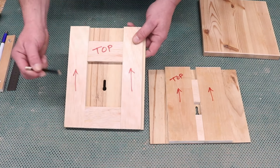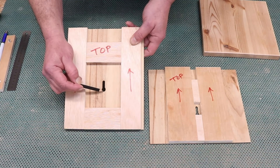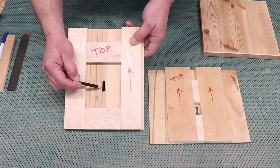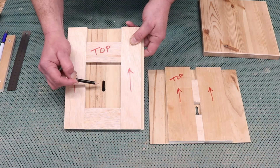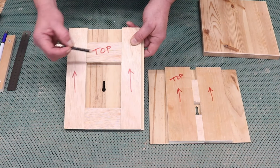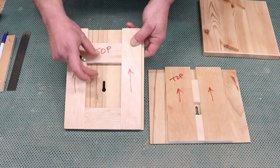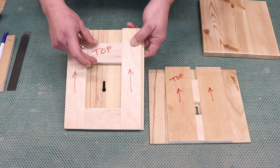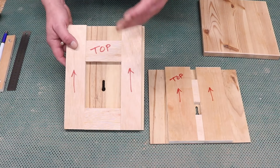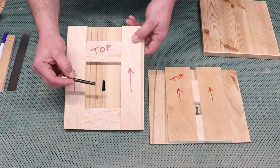As you can see, I have my hole which is the keyhole to let the head of a screw in, and I have the 20mm slot that I had set the jig up to create. Now if you don't need that to be 20mm — if you want it to be half that or longer — the beauty of this is you can just move the top piece to adjust the amount of passage in the jig.